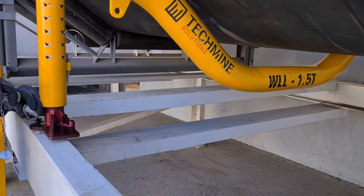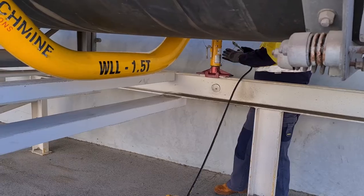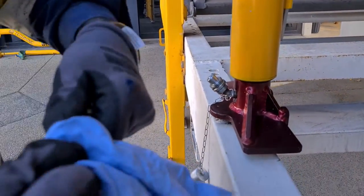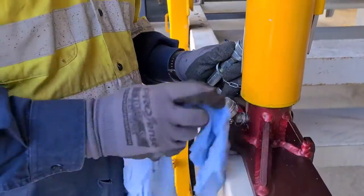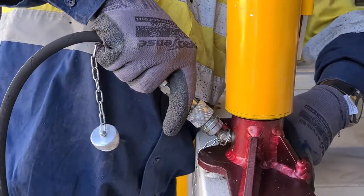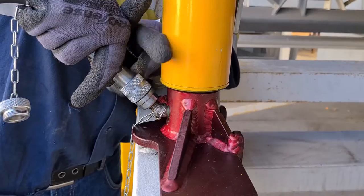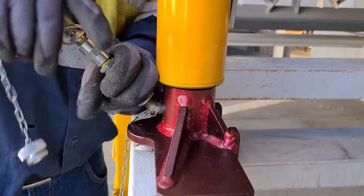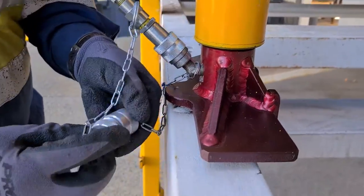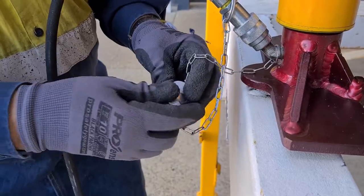I've passed the hose over to the other cylinder. Make sure our fittings are clean, free of debris — all wiped clean, both ends, both faces. We want to make sure that that hydraulic connection is home, all the way secured. We want that nut done all the way home. Connect the two blanks to keep them clean.